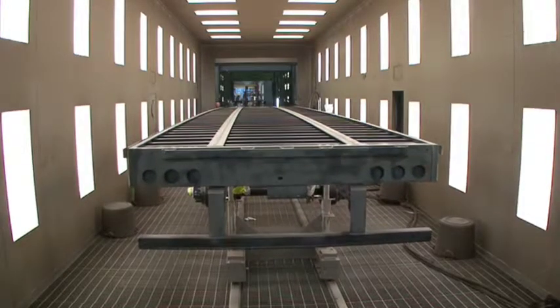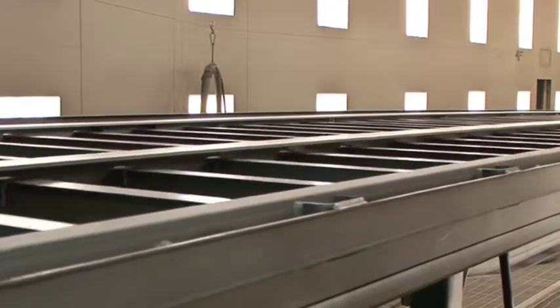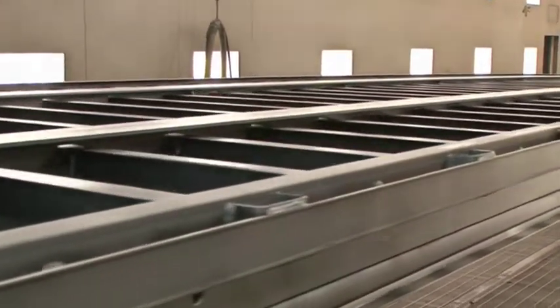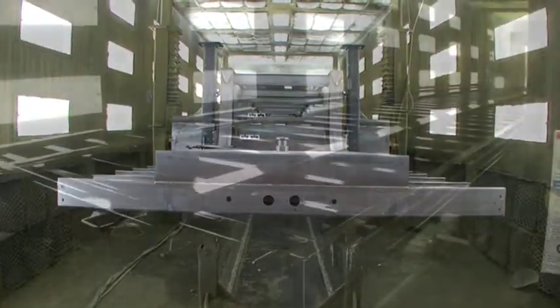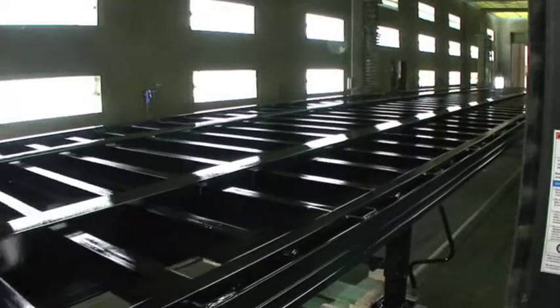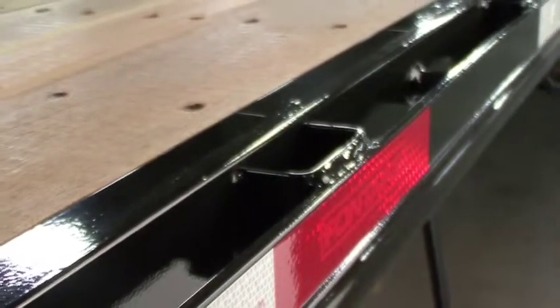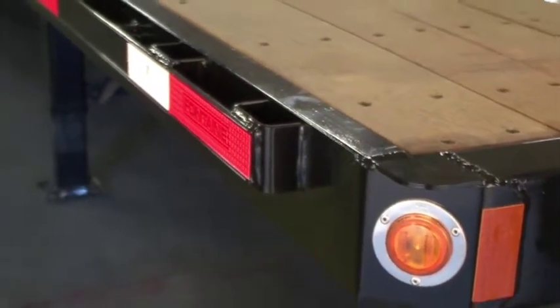In order to provide the best possible protection and finish, all Velocity trailer frames go through an inline steel shot blast to remove all loose scale and oils prior to receiving the primer coating to achieve the best adhesion. After the primer coating comes a high-quality urethane top coat. The trailer frames are primed and painted prior to the installation of flooring to ensure maximum coverage and protection. The trailers are standard with both stake pockets and pipe spools located on 24-inch centers on the sides, which are also approved load securement anchor points, featuring full continuous welds for optimal strength and safety.